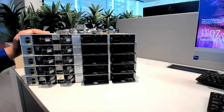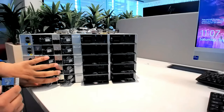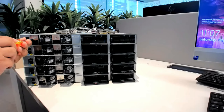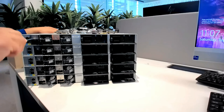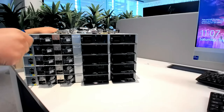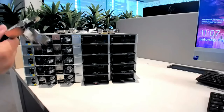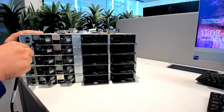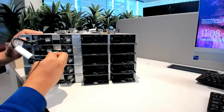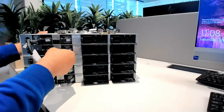These are my five switches and I'll build a stack of them together. For this we need a stacking module — I already fixed the remaining modules and kept this one for this session. You just connect it and tighten it with a screwdriver and it will automatically move inside gradually. The second thing you need is the stacking cable. You connect the first cable with the first module, and then the second cable goes to the second switch port number two, building a ring of switches together.